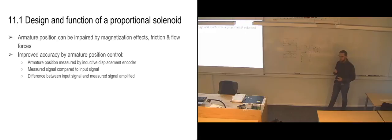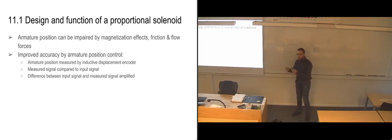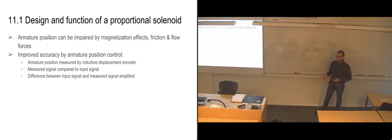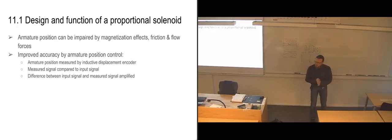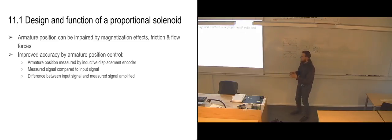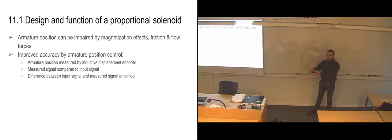That makes it a bit easier when you're creating external tools like that Mantis saw, because you also know that the regular operating pressure of that particular ROV was 210 bars, if I remember correctly, and our hydraulic motor running our saw blade needed 180. So we were thinking to begin with that we needed to put in a pressure relief valve in front of the motor so that we were sure it was delivered 180.